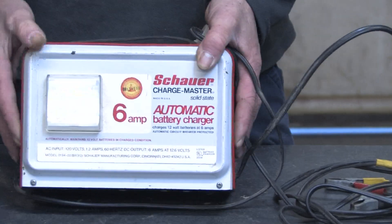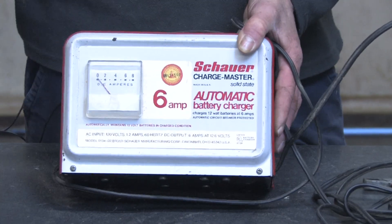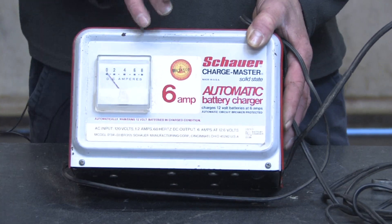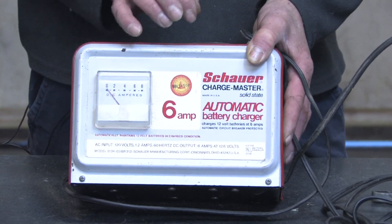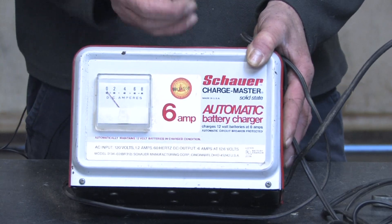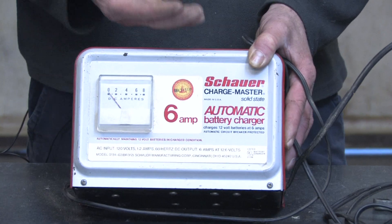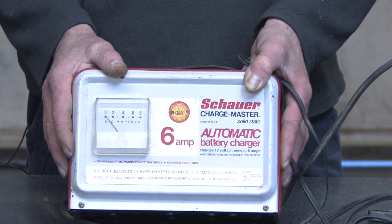How it does this is by taking the 110 volt AC and converting it down through a step-down transformer to a lower voltage, usually somewhere between 24 and 28 volts AC. That goes through a full wave rectifier or a half wave rectifier, which removes almost all or some of the AC sine wave, converting it into a full DC or partial half wave DC voltage used for charging automotive batteries. That's how an auto battery charger works.